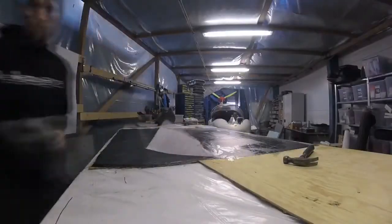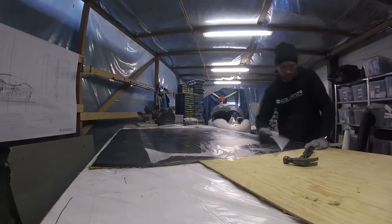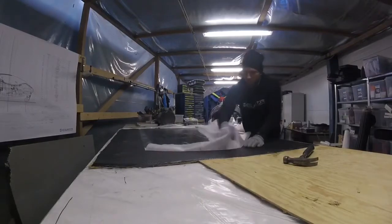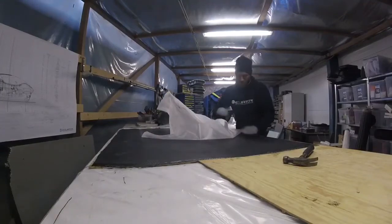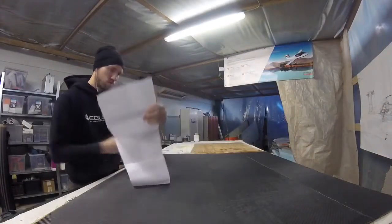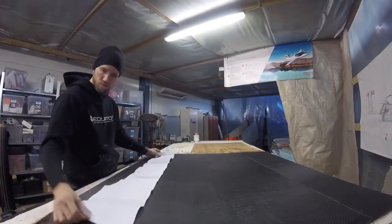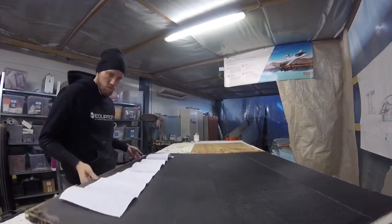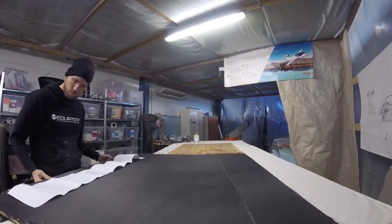The boards we created were based on a plywood core, which is a really good way to create very rigid walls for a box. I laminated a piece of plywood on both sides — it comes out quite heavy, but you want something seriously rigid to hold a battery pack that weighs about 100 kilos. It also has to sustain a crash of about 9 g's, so this pack has to hold about a ton.